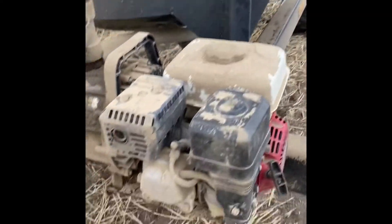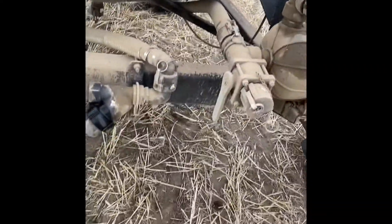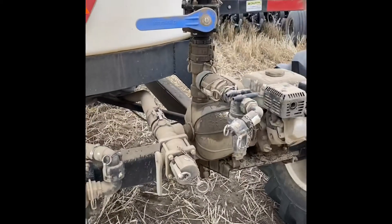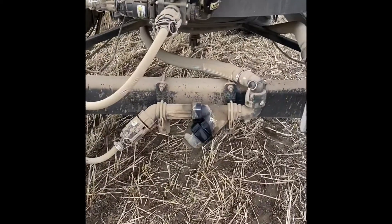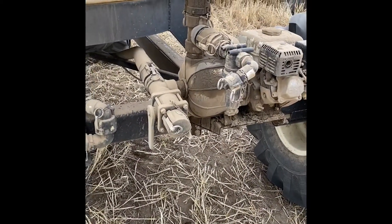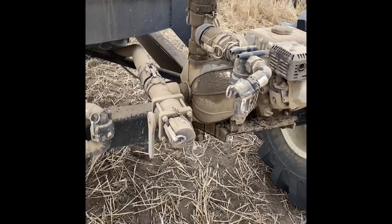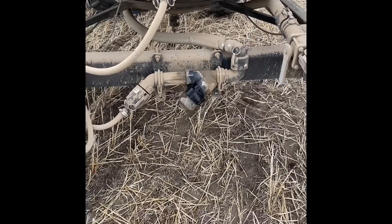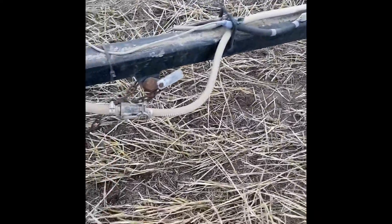So that's the cart portion. There's a transfer pump, two two-inch valves off the bottom of the tank feeding into a strainer. We also figured out that agitating with this pump for just a little bit after the liquid sits for a while stops us from having slugs in the strainer, which we'd had trouble with in the past. You don't want to over-agitate or you kill some of the bugs, but remixing gets everything back in suspension - and that heavy stuff settling out, those fines, is where a lot of the fungus is when you look at it under the microscope.